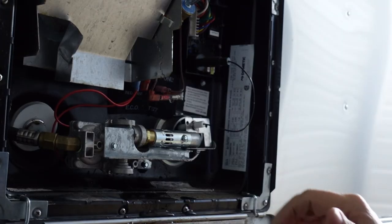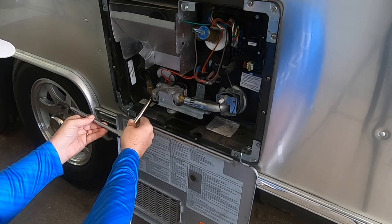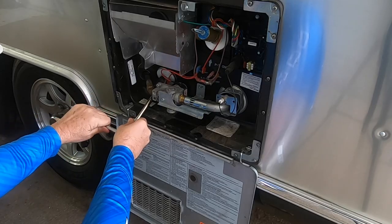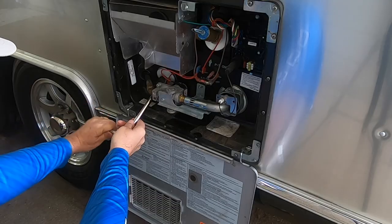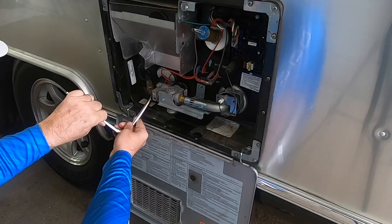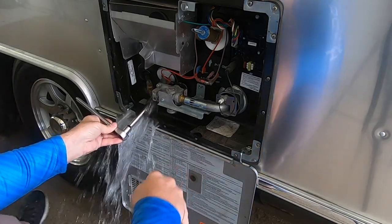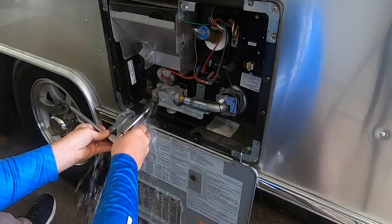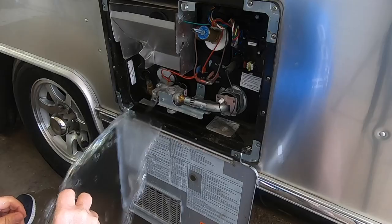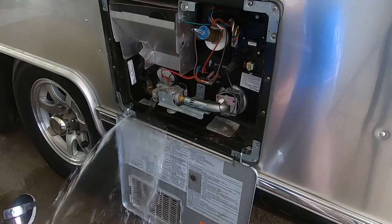This is the pressure relief valve. Go ahead and open it by pulling this tab and be ready for a little water — that relieves any pressure in your tank. Once we take the plug out, there's going to be a gush of water coming out and we don't want to get saturated. Use your 15/16 socket, place it on the drain plug, and using the extension turn the drain plug counterclockwise. Be prepared for a sudden blast of water — depending on whether you have a 6, 8, or 10 gallon tank, that's how much water you can expect.